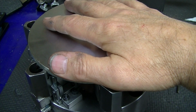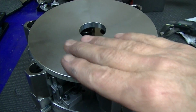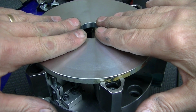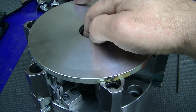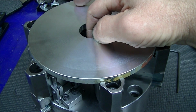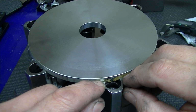Well, the problem is that if you're not aware of that, you machine this off. Let's say your lathe faces off perfectly flat. You take it out, and when you relax it, this now goes back to its at-rest condition, and this thing is concave. You're thinking you've got a part that's nice and parallel, but you can't figure out why, when I face this thing, it is 15 thousandths thinner in the center than it is out here. Well, it's because this grip is causing that condition.